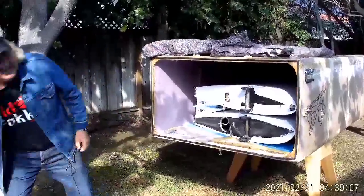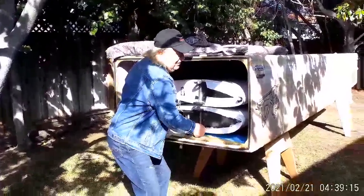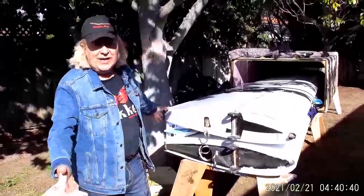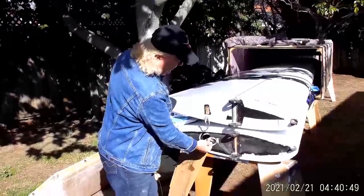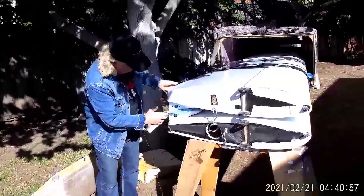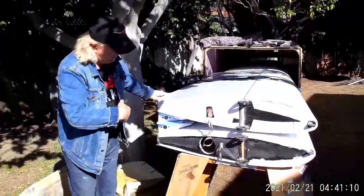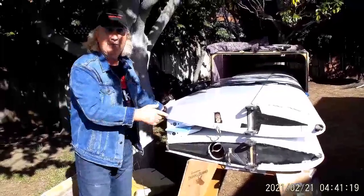Normally in the field you set this aside, come in, lift up the two main wing panels together, and slide them out. I've put it on a sawhorse here to show you the padding system. Nominally it's transported with the control cables wrapped up — they just hang there and they're fine. The flaps, in order to keep the transportation box narrower, are designed to move all the way to the inside and sit on top of each other with a little pad in between. That saved about three inches of width on the box, and when you deploy, you just take the straps off and the spring returns the flaps around.